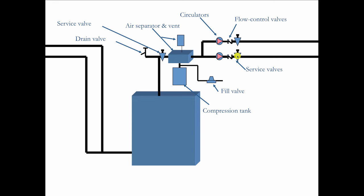And then I close this valve, and I open the second zone, and the water then shifts this way, fills up here, comes through the already filled boiler, and when it's running air-free, I shut off the fill valve. I open all the valves, I start it up, and now that I'm pumping away, these circulators are going to send their full discharge pressure, their full differential pressure out toward the system, which is going to take these little bubbles that are trapped out there.